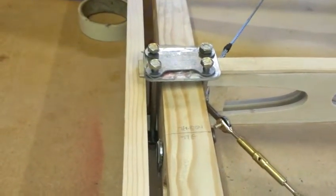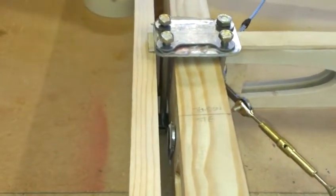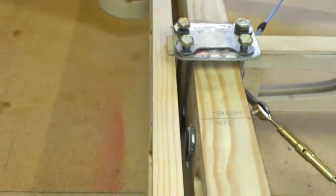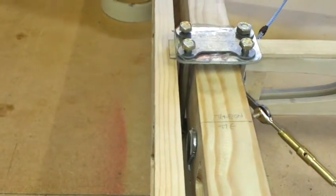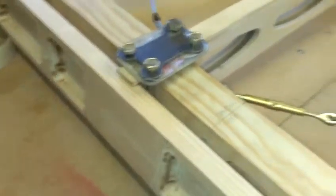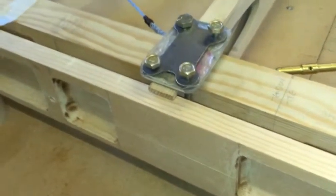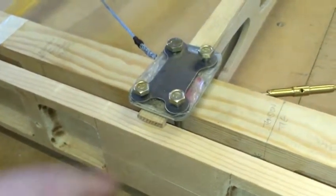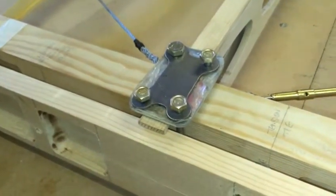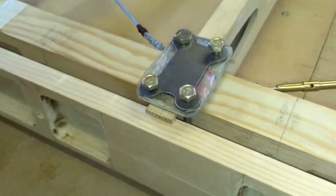This is actually jigged up currently to 18mm, so it's slightly large, but as you can see there's not enough space here for the aileron to rotate over any significant angle. We think possibly, although it's not shown on the drawing, that the solid part of the spar here was intended to have a cutout made around that point in order to accommodate the additional movement, but there's no evidence of that on the drawings.